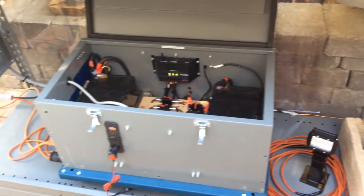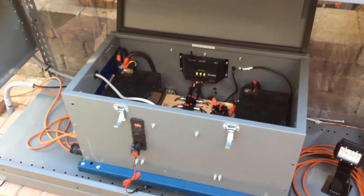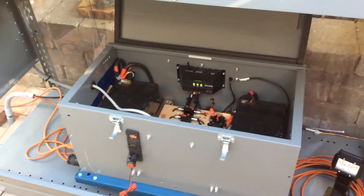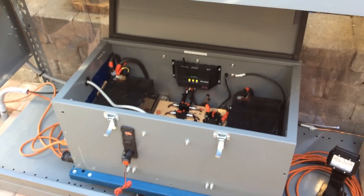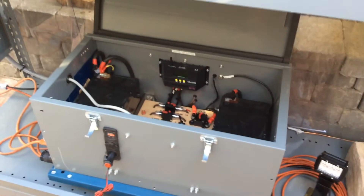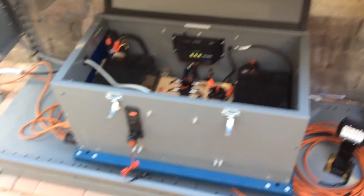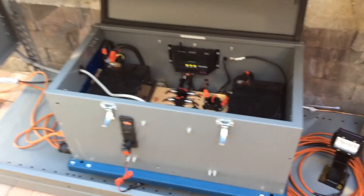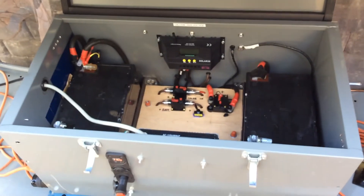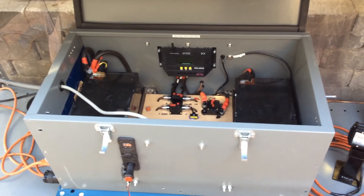That's a little lowdown on what you can expect to get out of a little tiny system like this. I hooked it into the house and put more panels up — why would you build this thing and not utilize it? If I just stick it in my garage, the battery's going to drain down. Now I can supplement my other system. I run the patio lighting off this instead of my other system. At night this thing literally takes off 400 watt hours from that system, which doesn't drain my batteries down as much. If the power goes out, now I have two systems. If my inverter takes a dump, I have another system right here. So, there you go.